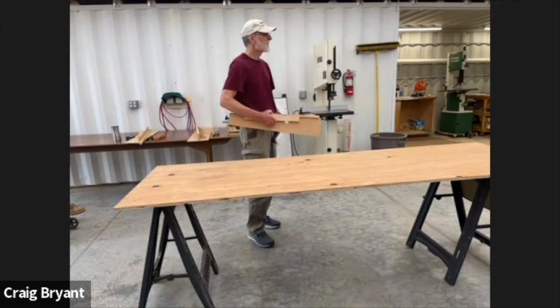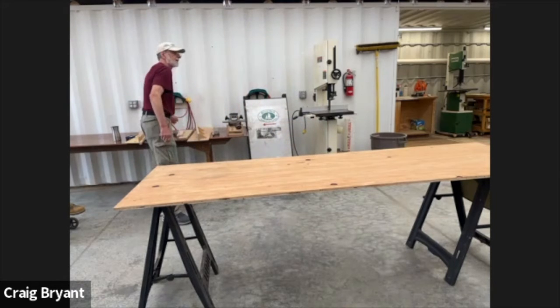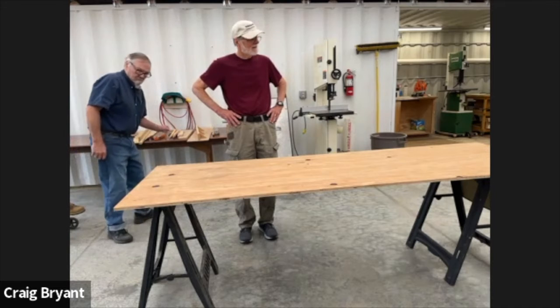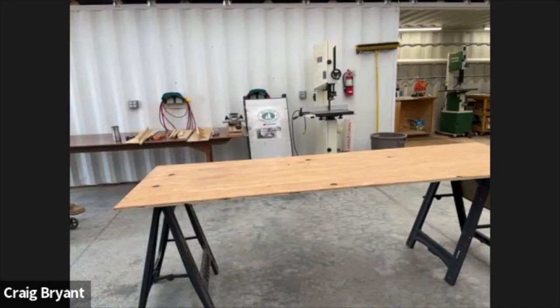One other thing about that one, Mark, all of them actually, it's really nice to have a mobile base on your table saw, because I need to rotate my table saw 7 degrees from square with my shop. Yes. Because if you've got a stave that's 10 feet behind you, it's going to run into something. Your alley for ripping long boards is typically fairly straight, and when you're running this through at an angle, you've got to match the angle. Yeah. Rotate your saw. And in my case, I have to open a set of double doors so that I've got enough in-feed. I had to open the garage door and the back door for the mast on that current project.